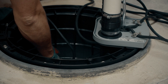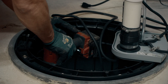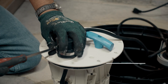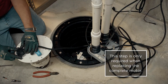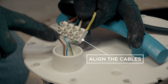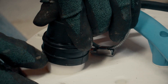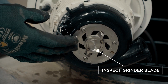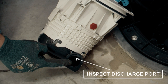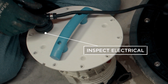Take the screws out for the pump, close the valve, now pull the motor, and disconnect the wiring. We just have to line up brown to brown, blue to blue, white to white, and green to yellow-green. So for serviceability: we can make sure the blades are clean, make sure the discharge is clear. If they are clogged, we can easily unclog it. Make sure our electrical is tight.